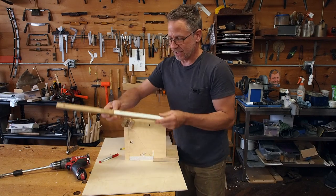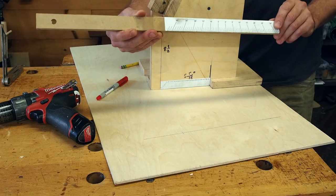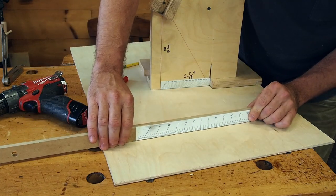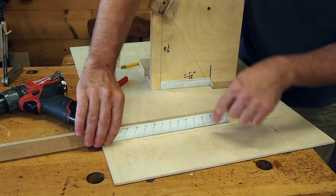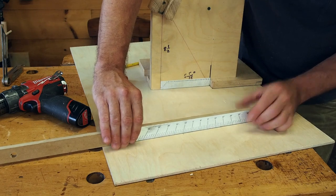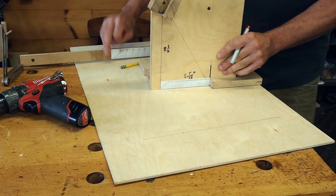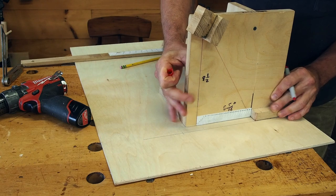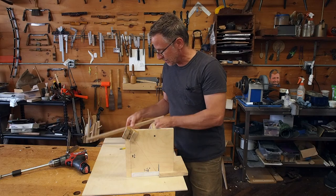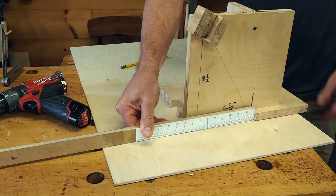I have a full-scale reference available on my website under the drilling jig plan — you can download the PDF for free. Let's say I want to go 10 degrees leaning this way. The fixture works both directions using the same jig. I put a little red dot on the scale, then when I put the fixture up against that red dot and drill down, it's going to be exactly 10 degrees. You can double-check it by putting the angle gauge here and you'll see 10 degrees lines right up — it kind of can't be wrong.